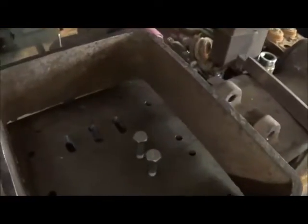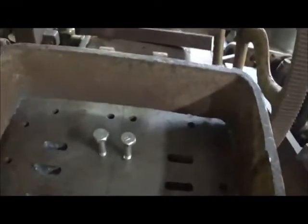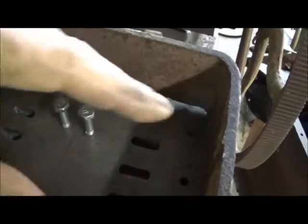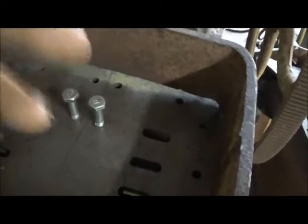We're back on this steam chest. Laying in bed last night thinking about the intake ports and putting air to it — we need to put air to both sides. I was thinking about why I was putting a piece between them to separate them off, and I've come to the conclusion that I don't need it. I was assuming that with it being a two-cylinder duplex we needed two separate compartments, but one pressurized compartment is going to be the same as two.